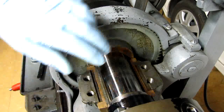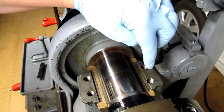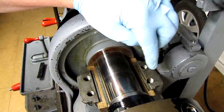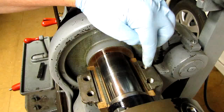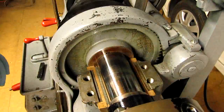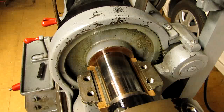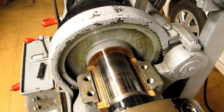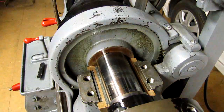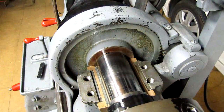If you look at the bearing cap, the top where the hole starts into the bearing cap up here is also a little offset, and then it just kind of carried on through at an angle. I was surprised because everybody hears about the precision of South Bend lathes. I was amazed, frankly, but at least I got a decent looking spindle there.